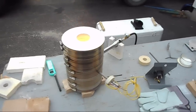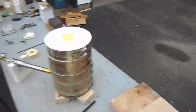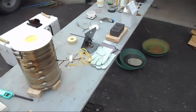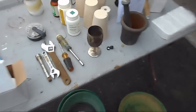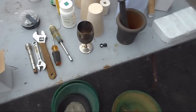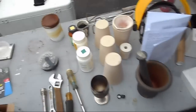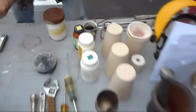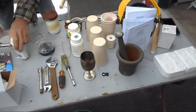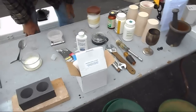We're almost ready. We were supposed to get it up to the higher temperature for 15 minutes, and it's basically been that — so we're about to start tightening the bands. We do have one problem doing these small melts: that's not very much material, but we have these big crucibles. So we're kind of overkill on the crucible for the size of melt we have. We do have a smaller crucible but it's ugly and old. I think we're going to use the big one and just hope we can get it fluid enough to pour out of such a big container.